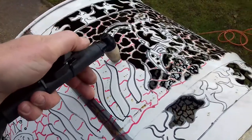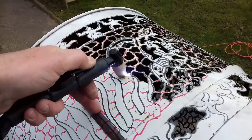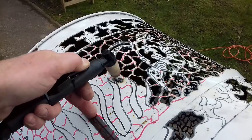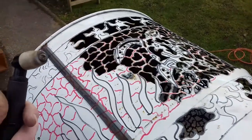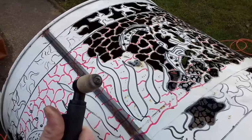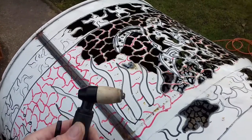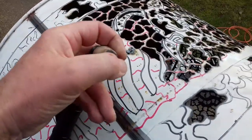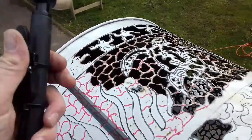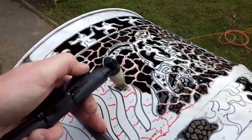Watch me cut it now — you go on the bit where you've chipped the paint. That's because that contact tip inside is buggered, so we'll change those tips up. You can see that end there. Generally I change the tips when I start every new job; I haven't bothered on here because there's so much paint.